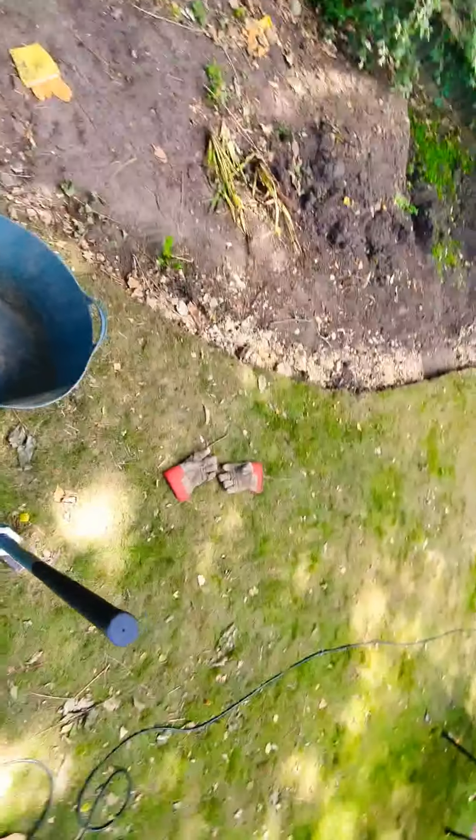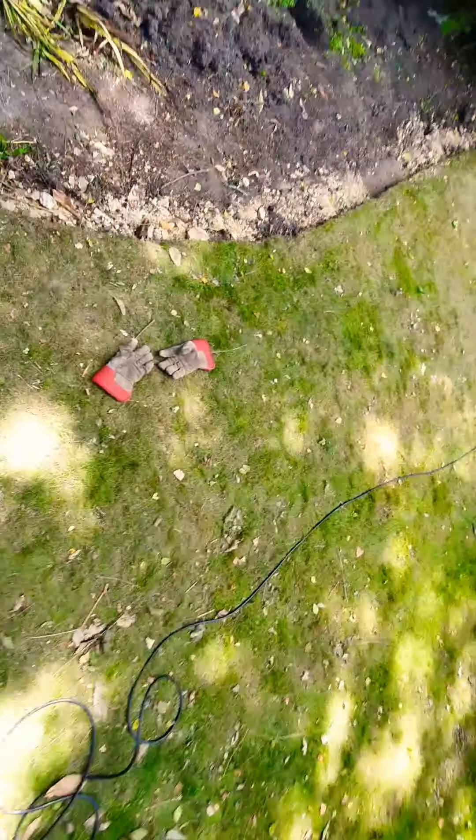It's going to be five foot in total depth — two foot below ground and three foot above ground. We're digging down three foot so we can have about a nine or ten inch concrete base. The base is going to be C-35 concrete with reinforced mesh, and we're also going to have two bottom drains running through it.